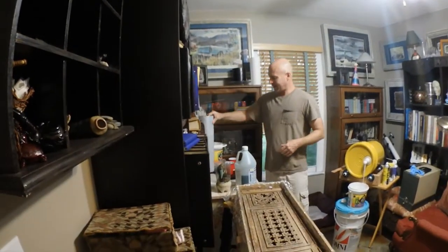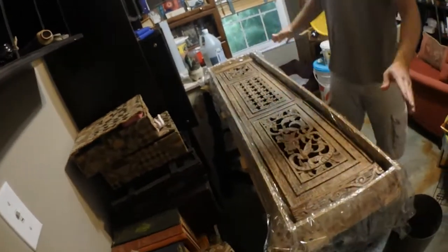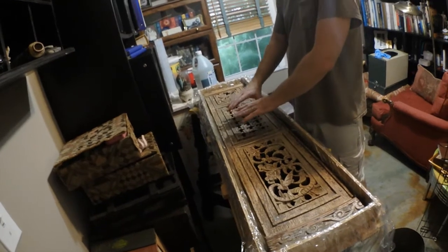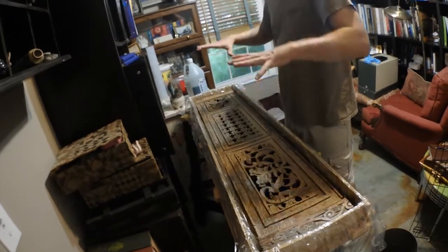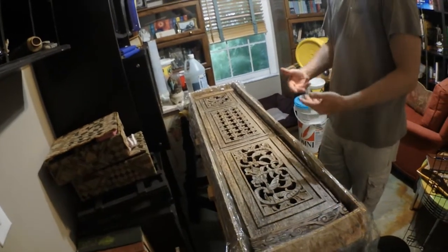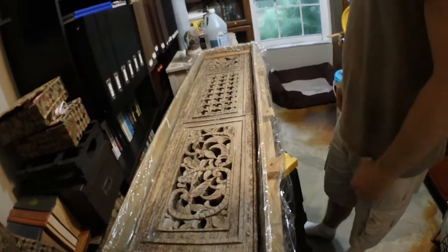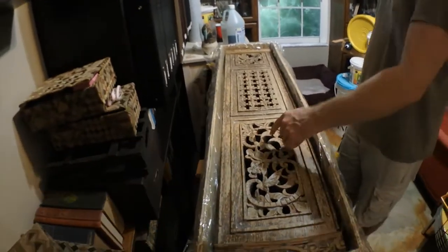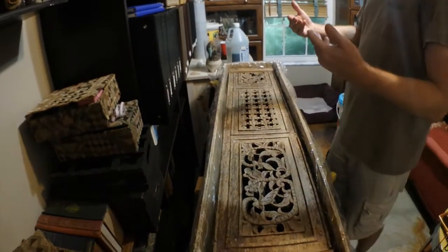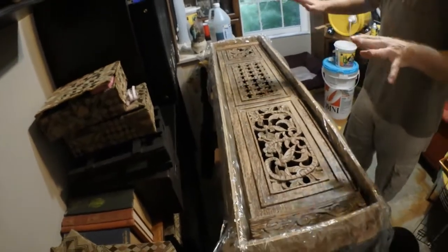We kept saving that plastic for something — saving for this, I guess. And laid that down over the sand, left the sand a little bit of a berm profile over the center, and then kind of pushed the wood piece in and shifted it down. So hopefully we're taking up a lot of that volume underneath, and hopefully it makes a nice enough transition for all these scallops and undercuts so not too much silicone will flow down, get behind it, and lock it in.